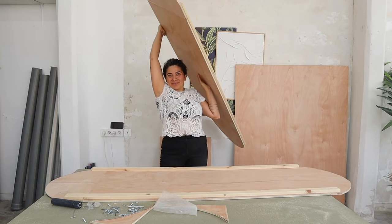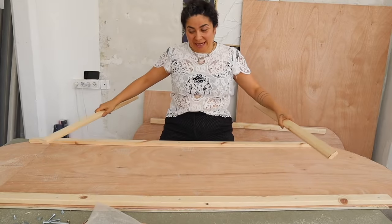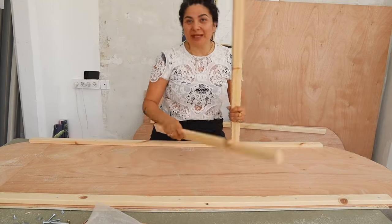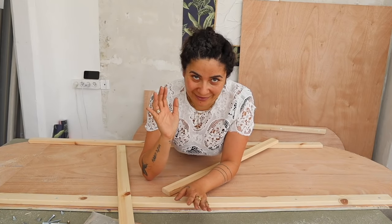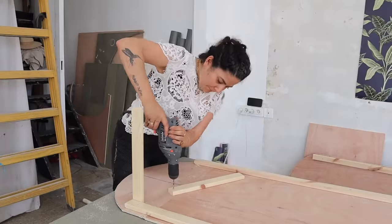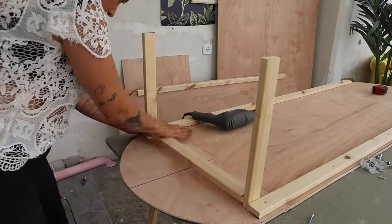We have the two of them — it works perfectly! Now we do the heights. The reason that we did this guide length is to create a border where the legs are not going to be able to move, so that it's extremely stable, it's never going to fall, and it's so much easier than the videos I saw online. Cut away all the legs that you need — we're going to use 37 centimeters, that's the height of our couch. You're going to make holes and screw them both on the right and on the left leg, then repeat this four or five times, and then put a central one to keep it stable.